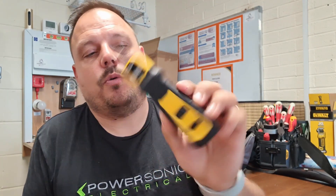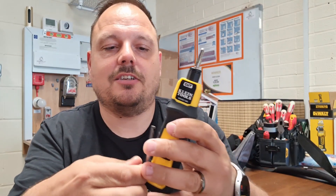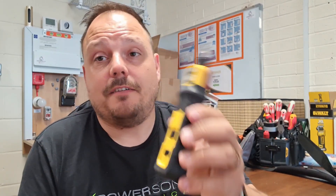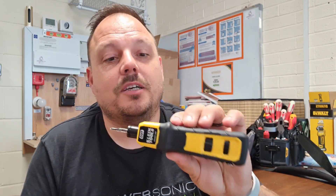Another data tool — this is a newer one for me — is the Klein Tools cutting tool for terminating into patch panels. You can see the end on there. There's a setting for low and high impact, you can release the blade and change the strength, and it has hook-out tools for dismantling — all in one comfortable product. I had budget variants before but went through five or six sets as they don't last long. The reviews from other people on Twitter were very good, so I treated myself. When I do data work I want tools that will work without a last-minute trip to the wholesaler.